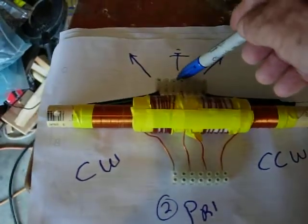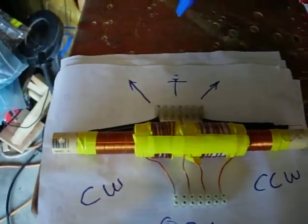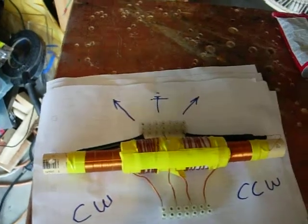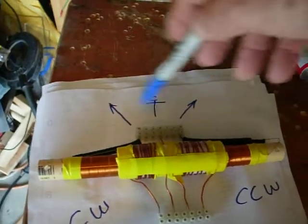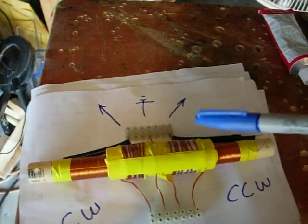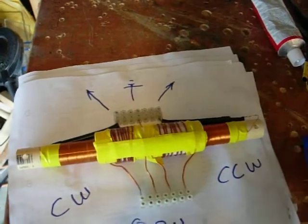The center tap can go to system ground or earth ground, and the output of this will produce high voltage DC to a cap, through a bridge to a cap, and then that'll be impulsed into a step down transformer, which will reduce the 2000 or whatever comes out of this thing down to whatever I need to keep the NiCad battery recharged. Or I can actually use some of my caps that are 500 farads. I could use one of those, which is 2.7 volts.